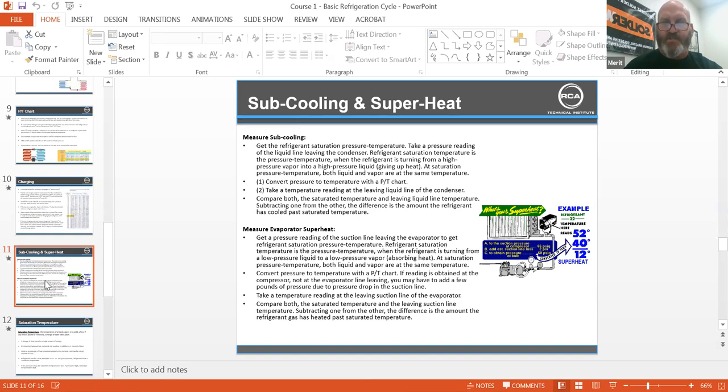On the Maverick side, there were a lot of guys struggling with the low boys icing up — partially icing. As they dug into it, what was shocking was that those coils run such a low superheat. So the key takeaway is: those cases run at a very low superheat setting.